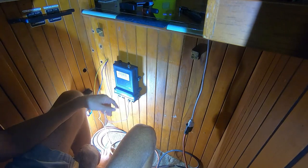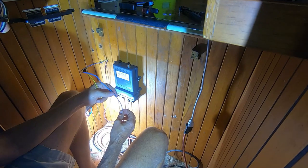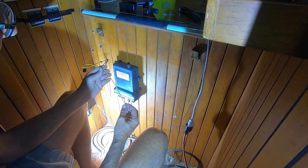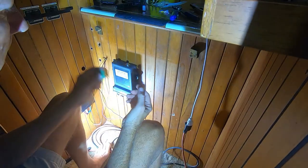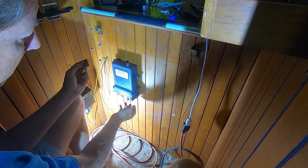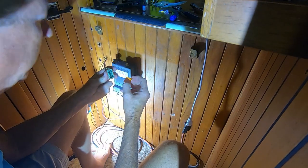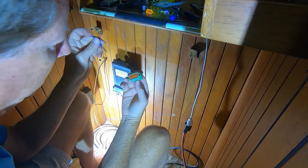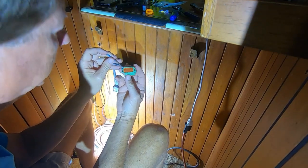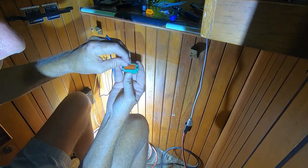We now have our RPM hooked up. The blue wire is for the temperature gauge on the freshwater coolant, and the yellow wire is my oil pressure sensor. The RPM used the brown connector; for the sensors you use the green connector. The water coolant temp wire goes into pin three — just shove it into the end of the connector and push until you hear it click.